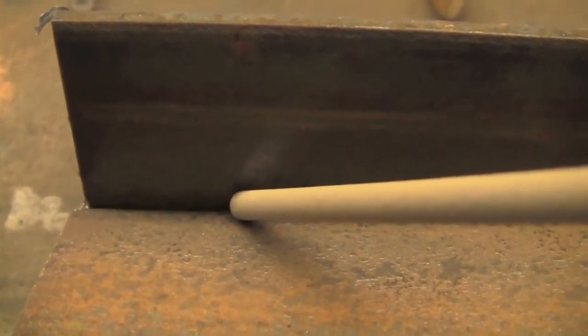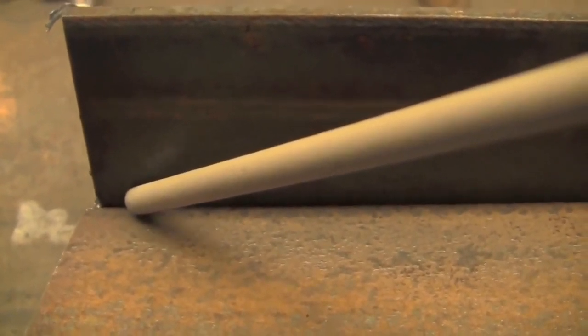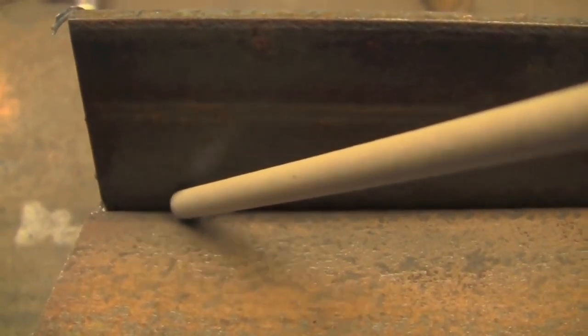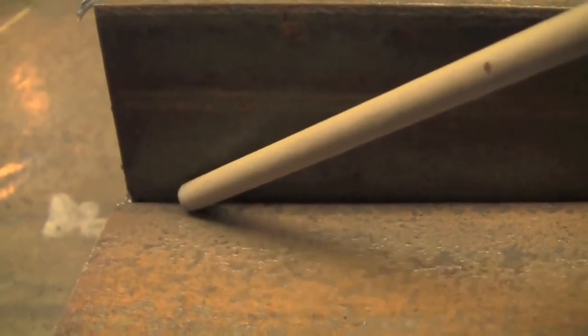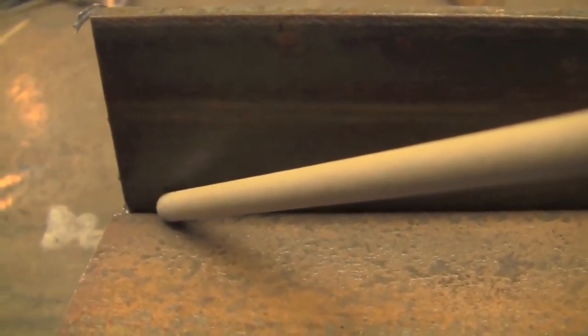You could train a monkey to do it. Once the monkey gets the hang of it, it'll turn out pretty well. Basically, what this does is when you move forward, you sort of dig out in front of the weld so you burn in a little bit deeper, then move back and reinforce the metal that you've already put down. Dig out, build up, dig out, build up — that's about what it boils down to. And this is how I learned to run 6010 and 6011.